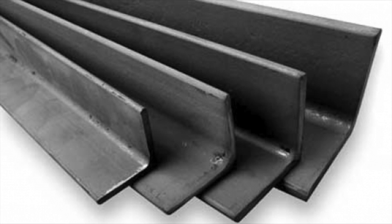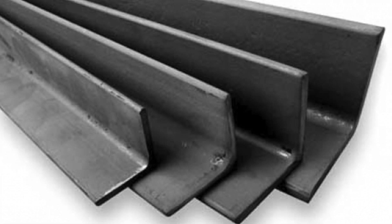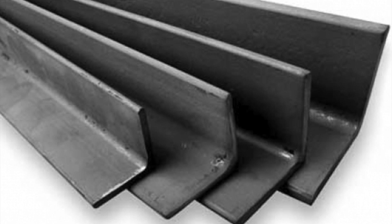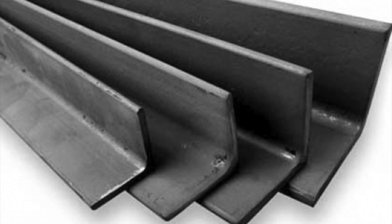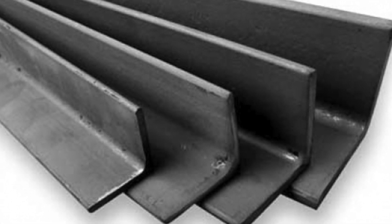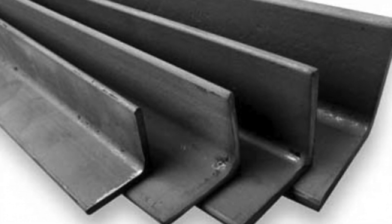Lastly, I don't have a picture for it, but you can go to Lowe's or a local steel supplier — even a scrap steel place — and get yourself a piece of scrap steel to work on. Some ¼-inch or thicker plate, or some 3-inch by 3-inch by ¼-inch thick angle iron about a foot long. Pick some up so we can have somewhere to start running beads. It's all about hood time and getting comfortable welding that rod.